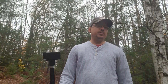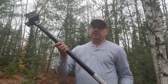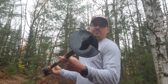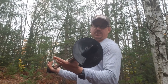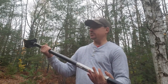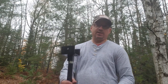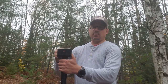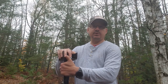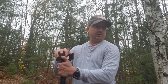All the rebar is in, and now we have these — the Pylex 50. These are screw-in anchors, pylons, or helical anchors. Each one of these is supposed to hold 5,000 pounds, and I have 12 of them, so I don't think we're going to have an issue. You're supposed to put it in the ground, start screwing by hand, put a 2x4 in the hole, and walk around in circles until it screws itself all the way in. I'll try one first and then get one on video. I have 12 of them, so hopefully they go easy.